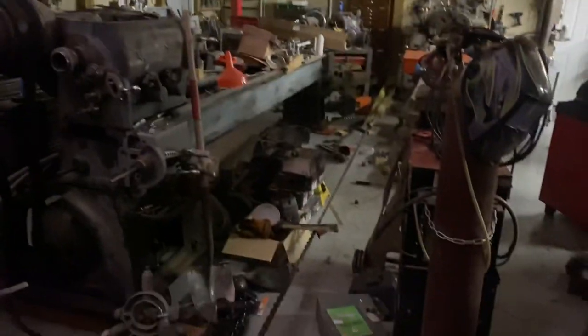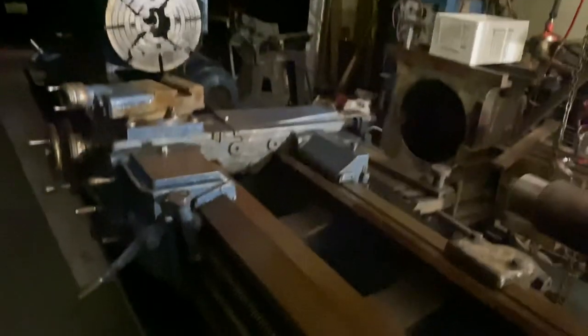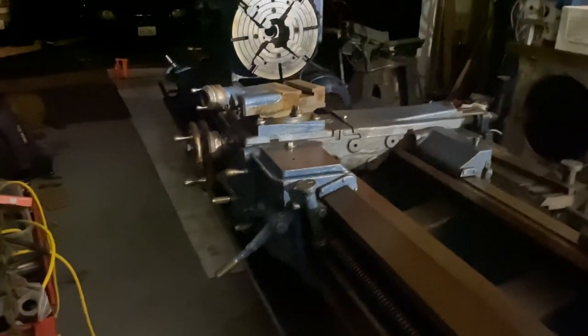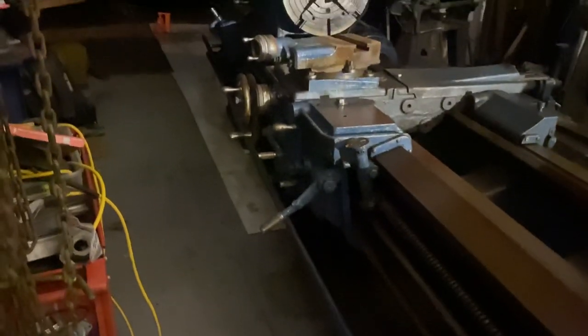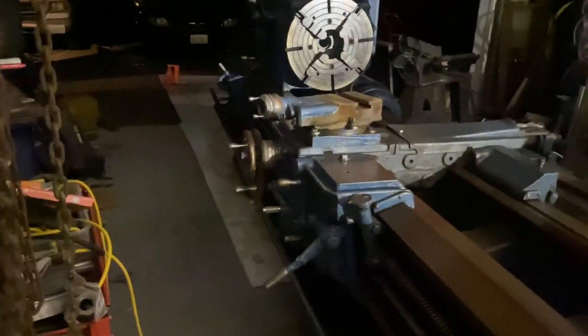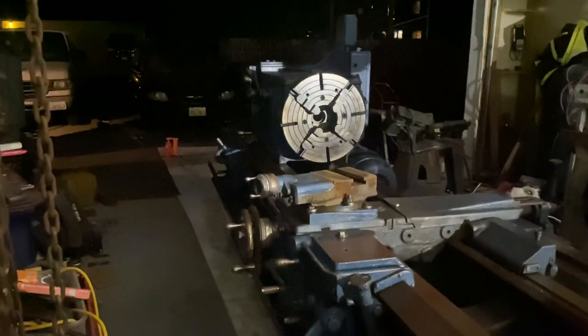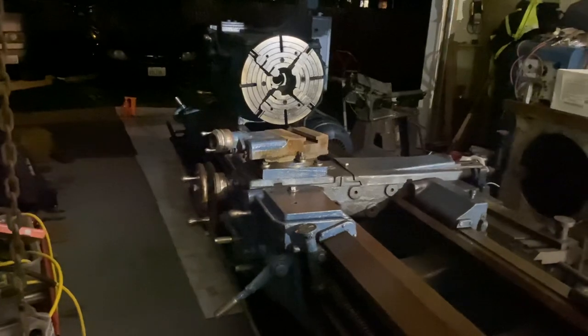It's a little tip for you guys. I'm going to get busy — I've got this lathe to move to the side, get the other lathe into position, run the power for it up here and do a drop. There's just enough room to snake that guy through the side once I move some stuff. I just wanted to show you how that system really really worked. I'm very impressed with that UHMW — it also machines real easy, so it's a handy thing to have around. You can use it for low-speed bearings on certain applications. This is Adam from Small Town Machine Shop — please comment, like, and subscribe. Thanks for watching.